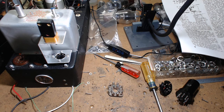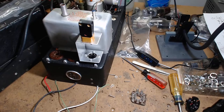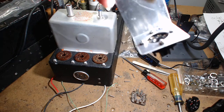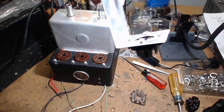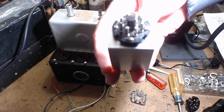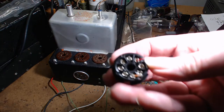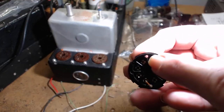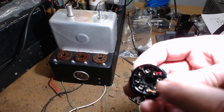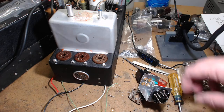But I just wanted to show you, I'm still on this, and it's not real fun. If you look at these bolts down in here, those are 2-56, and they're custom cut so they won't be too long. And like I said, when you drill this socket out, you're up in here. You'll notice there's a rim around this, and you've got to be centered in that rim. I've drilled a lot of these, and like I say, I don't call them Bakelite, I'm calling them Breakolite.